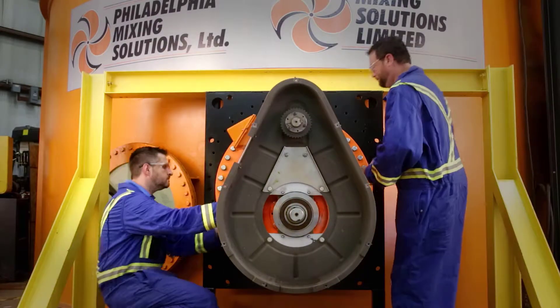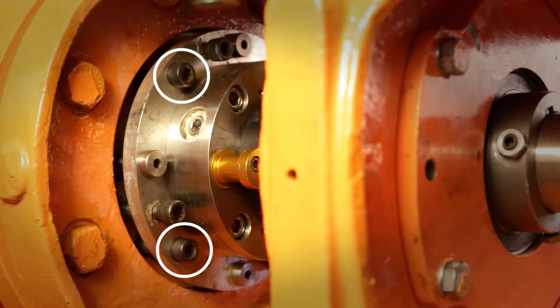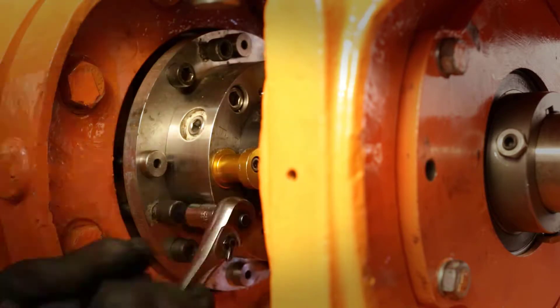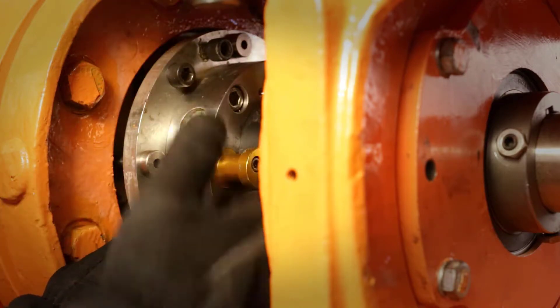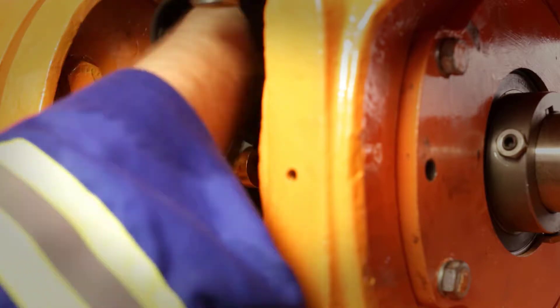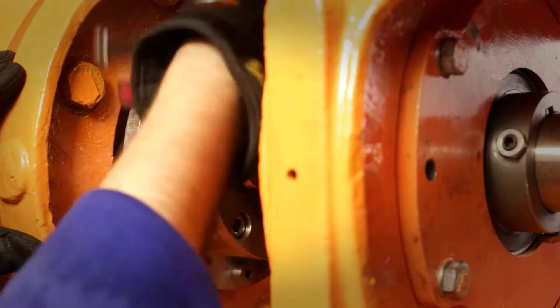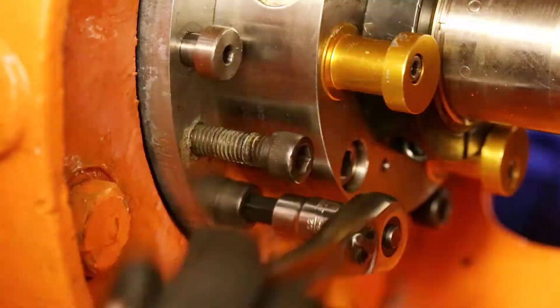This procedure works best with two people. To lock out the mixer, first slightly loosen up the L99 bolts. Once they're loosened, back out the U75 bolts until the tips are still engaged in the shutoff housing. Start tightening down the L99 bolts. As the bolts are tightened, the shaft will move through the bearing and sleeve. A gap will begin to occur on the rear bearing between the snap ring and the outboard bearing sleeve.